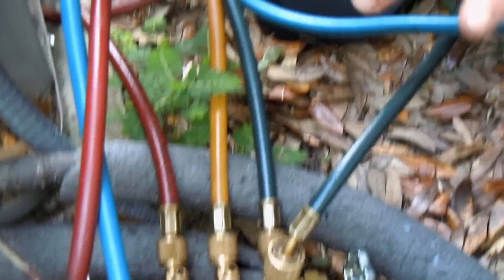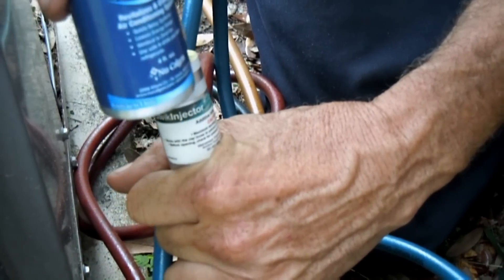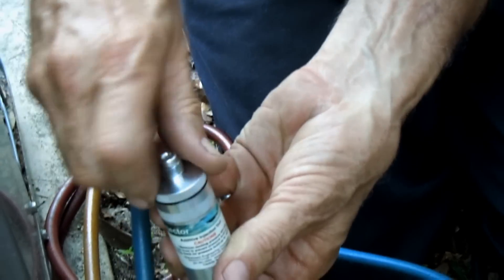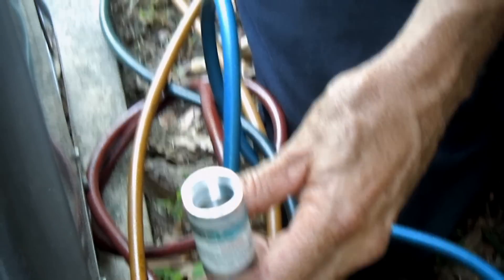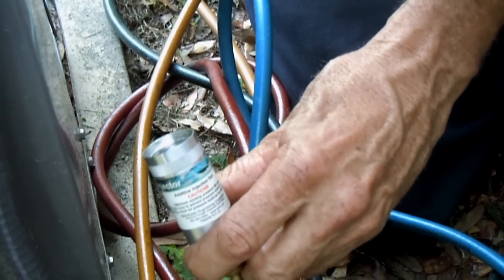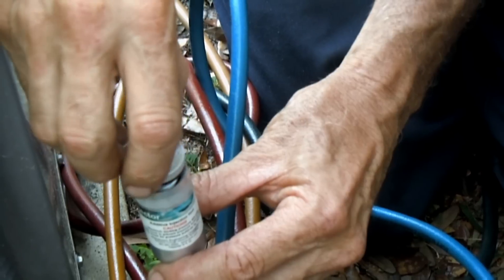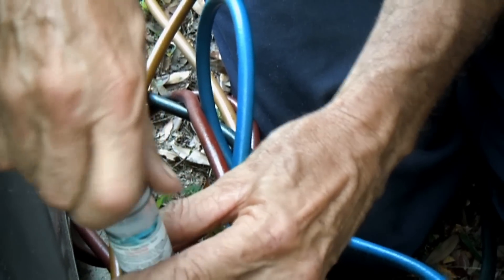What I want to do here is put the chemical — the AC Renew — in the injector. So I'll just connect that hose and open the container, the injector. Now, my injector tool is a little on the small side, so I'm going to have to do this a few different times. Anyway, fill the injector up to about where the threads start, and then put the cap on, kind of hand tight. And then put this hose on.